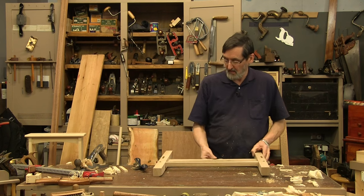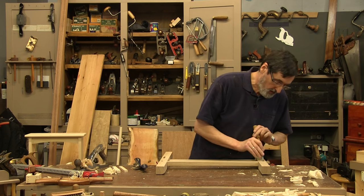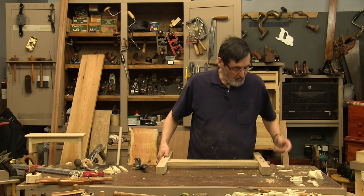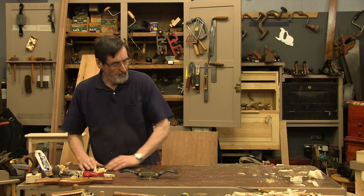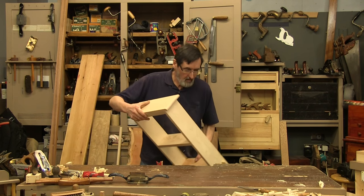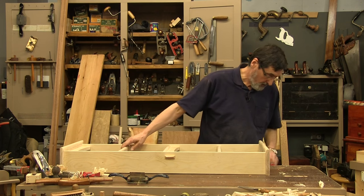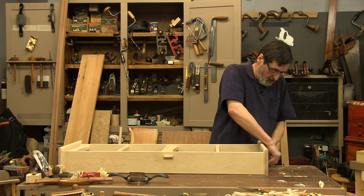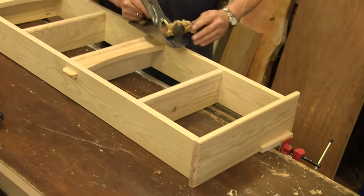You could also put the workpiece on here and work on mortise holes — if you needed to start chiseling out and cleaning up your mortise holes, you've got your workpiece anchored to the bench top. It works for other aspects, not just planing and scraping — it can work for sawing too. What about bigger pieces that need some extra fettling? Shims again — if you've already got the piece finished and wanted to shim it out, you can do that, then plane along the length.